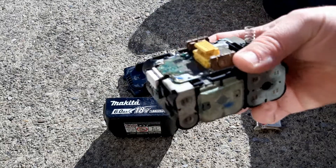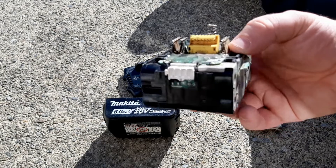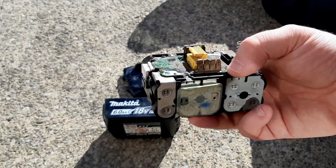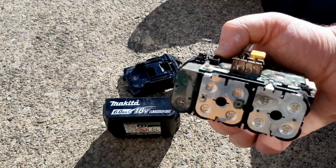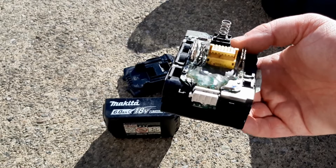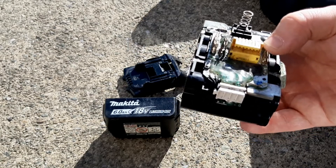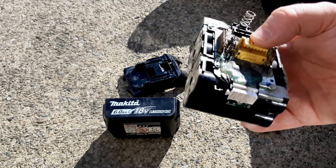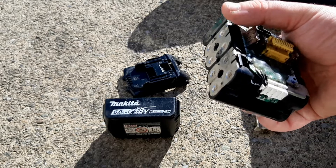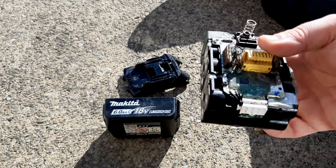I've opened up the battery and tested all the cells. I found the cells to be all well balanced, but low. I brought them up to voltage artificially by connecting to another battery — a donor battery. But this only brought the cells up to proper voltage; they were still well balanced. But the thing will still not charge.